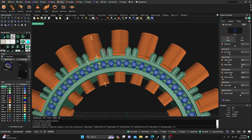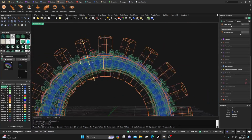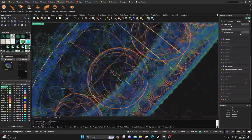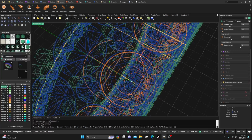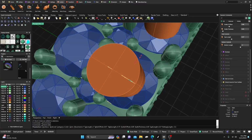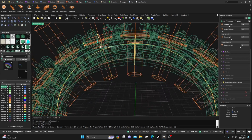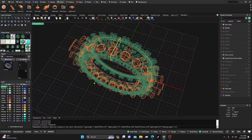And let's see, let's go in here, and maybe we want to make this bottom hole just a little bit larger perhaps. And I don't like cutting my prongs, and since I went ahead and joined them together, it's going to cut my prongs. So what I'm going to do is go in here and bring that in so that my prongs aren't going to be cut. Let's hide my stones. Yeah, so my prongs aren't cut, right? And then I'll go in here and re-bump that up just a little. Right? And then we'll go ahead and hit enter.